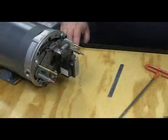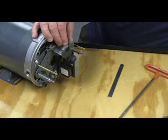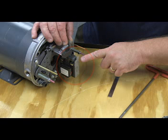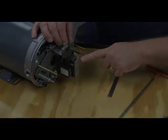Now we can check our work. Verify the plunger position is now at or slightly above the set line. This brake is adjusted. The air gap tolerance is between the set and reset line. It is important that the plunger is not below the set line, otherwise the brake may not fully release due to not having enough travel space for the plunger to fully release the spring pressure that sets the brake.